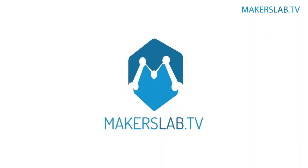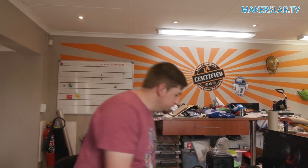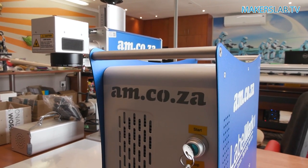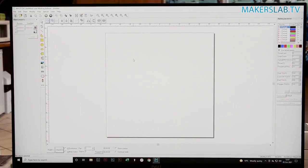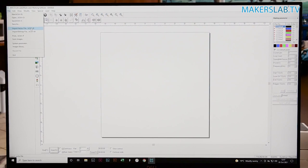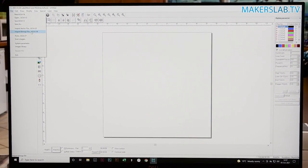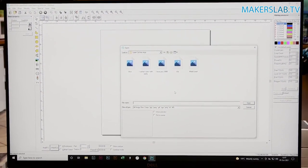The first process I'm doing is laser engraving, and today I've chosen the LabelMark which I think is going to be perfect for engraving on metal. The first thing we need to do is import our bitmap. This program allows you to do vectors, bitmaps, and JPEGs, so either will do perfectly fine. Today we're going to be using a bitmap.